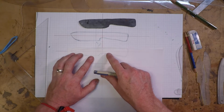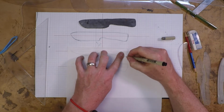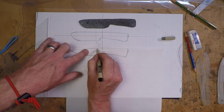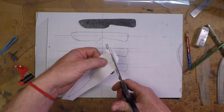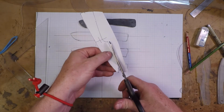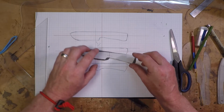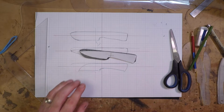So I copy my dark inked lines from my chosen design onto the tracing paper. I'm marking my centers and the point in the end just in case I come off of the paper and have to move it back and readjust it. I check and make sure that the paper pattern does fit correctly on the rough forged blade and still looks right to my mind.